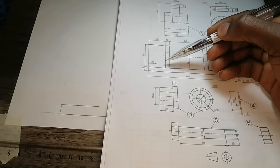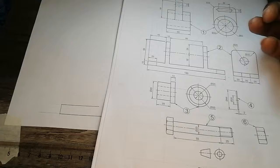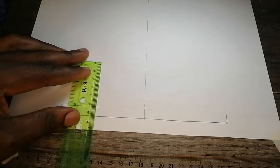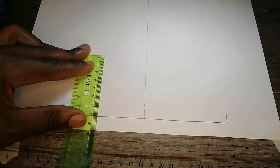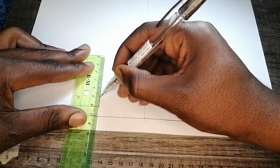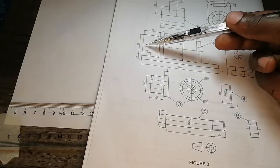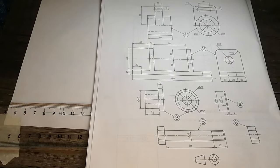Now I draw a vertical line from here with a length of 60mm — from there till there is that 60mm. Before I record that 60mm, I must firstly draw a faint line. On top of the correct vertical faint line, I record a dimension of 60mm. There is my 60mm, I can draw it dark. Where you see the end, you put a horizontal faint line. Remember, we are drawing this structure because it is the biggest of them all.